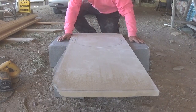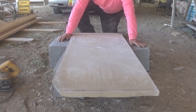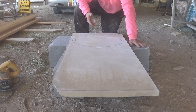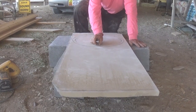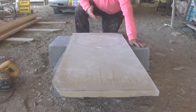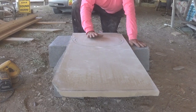Well guys, the wind is still with us. I came inside into the garage, mainly because that sun and heat is brutal — it's 98 degrees and just brutal out there. The only tools I have to make these cuts with is the circular saw, which is only a straight line, and my sawzall, which is a reciprocating saw, with some masonry blades. I'm going to make a cut in here with the circular saw and make enough cuts to create a notch for me to get the reciprocating saw in and come around and cut. But the odds are it's going to break.